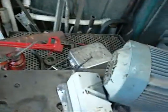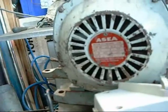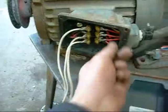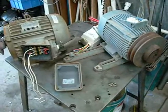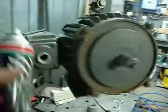I've got to figure out which one's best to run. Either way I'll get these both cleaned up - they're both good motors. That one doesn't say anything on the back, but this one's definitely a star and it's 2-speed; these wires can be swapped around - they're probably 1 speed there, and that's the second speed in there. It's always nice when manufacturers put lifting bolt holes on these motors so you can hang them up and work on them at any angle you want.